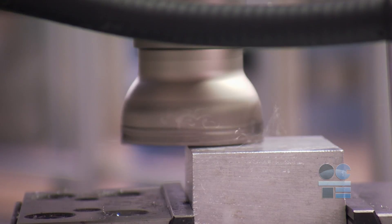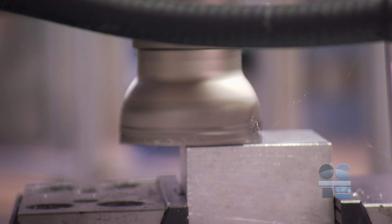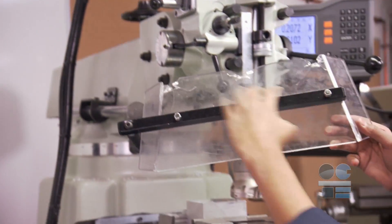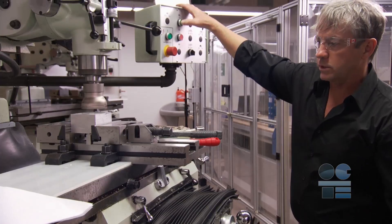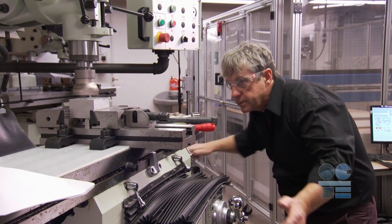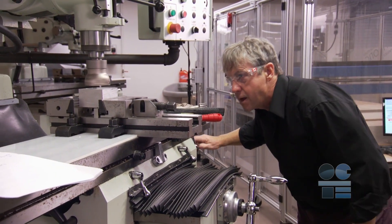You can protect yourself and others from dangerous, hot, and sharp cuttings and accidentally broken cutters by using available guarding. Make sure guards are tightened and positioned correctly before starting. Especially if automatic feed is used, start cutter rotation and feed from a distance while clear of the workpiece to prevent sudden and unexpected impact.